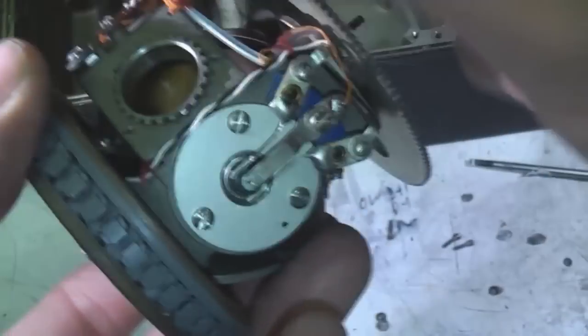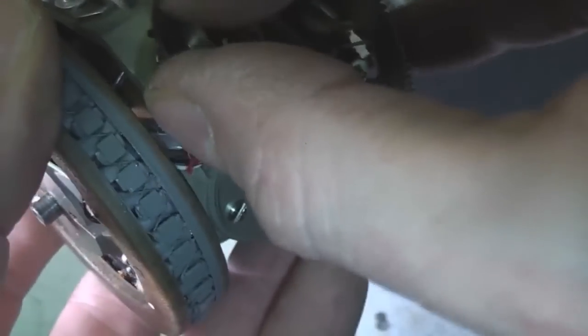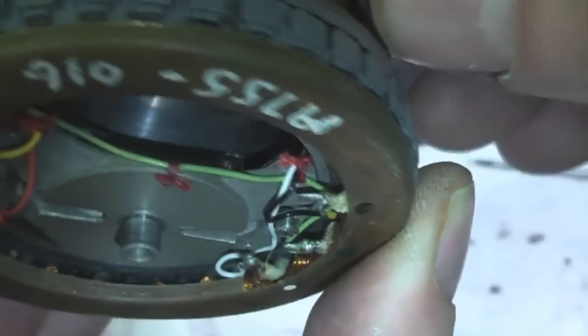So I wonder if this is either sensing or actually exerting force by, if you put some current into that coil, it'll produce some eddy current drag on this, which looks like it's probably brass. Looks like that's mounted in a sleeve, so I'm guessing that sleeve probably adjusts the position so this gets quite close to the rotating part.